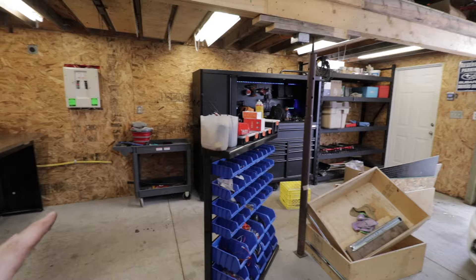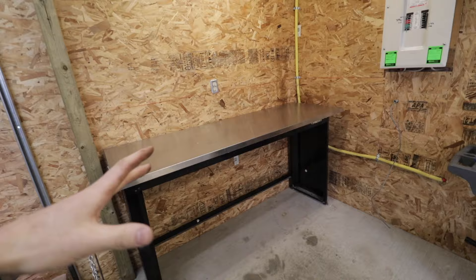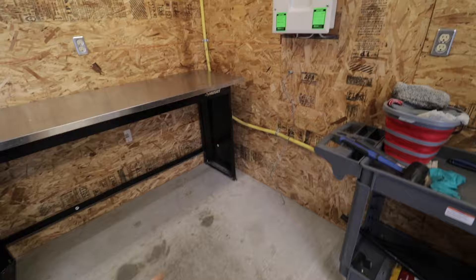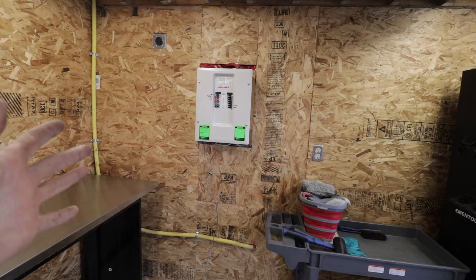I've been playing around with ideas like crazy and I think I finally know something I'm going to like. I'm not really liking the placement of that workbench in the corner, and I'll show you why. A workbench should have open space on both sides in case you need to view what you're working on from a different angle. Also, this electrical panel is too close for comfort — I don't want to be grinding and welding right next to it. So I'm not the biggest fan of where it's sitting right now.